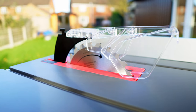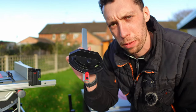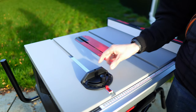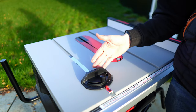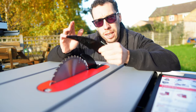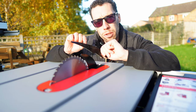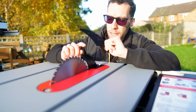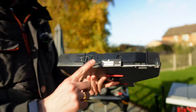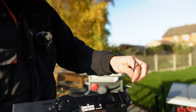Both models come with an included blade guard, which is very easy to put in. Both saws also come with one of these mitre gauges — it's not particularly impressive, it's exactly the same sort of quality you'd get from something like the Dewalt or Evolution table saw. Both saws come with a riving knife: one for a 250mm blade and one for the 254mm blade already on the saw. And both come with all the allen keys and wrenches needed to change the blade or make calibrations.